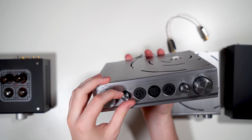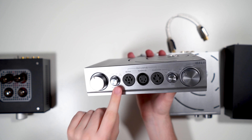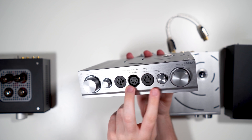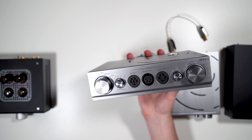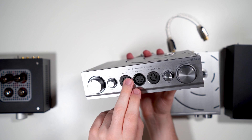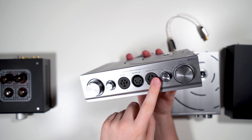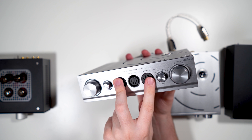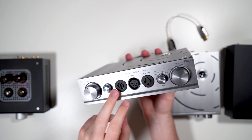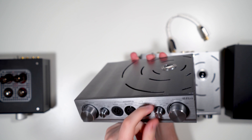The AC termination switch has four positions: off, normal, pro, and pro plus. Off disables the electrostatic outputs. Normal activates the old-school six-pin Stax connector. Pro activates the Pro bias connector. Pro plus turns both on simultaneously.